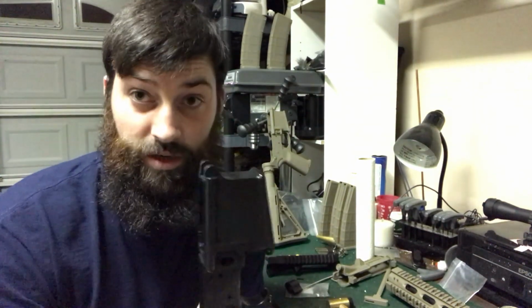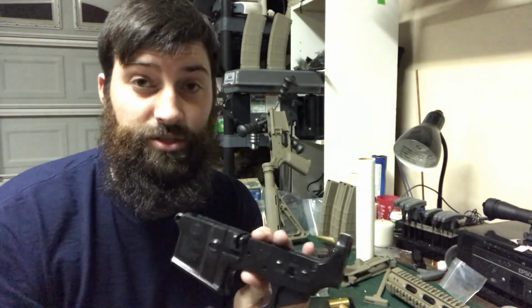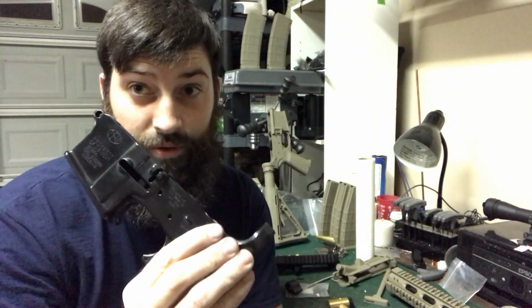On your acid bath, it's a 1-to-1 ratio that I used, and I think it worked out really well for these. I don't think I took any still pictures, but I got it in the video. It does anodize it. It has a grayish hue to it and everything like that. It definitely anodizes it, that's for sure. I used 12 volt 6 amps the whole time. This guy sat for about 3.5 hours.